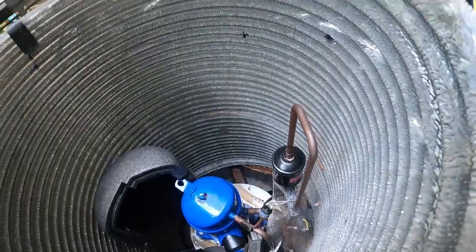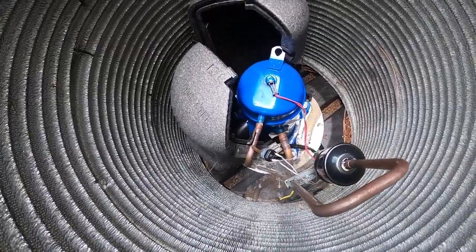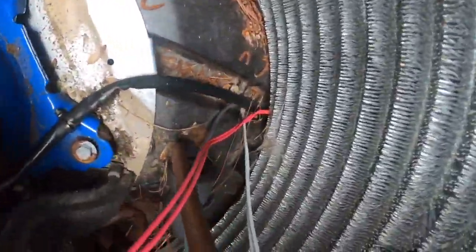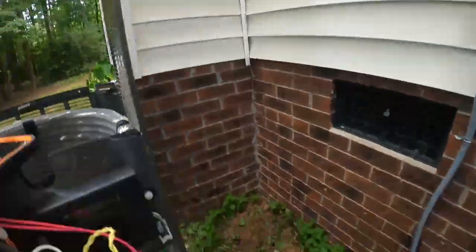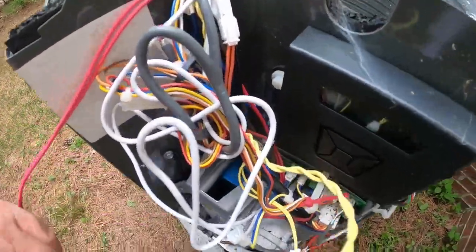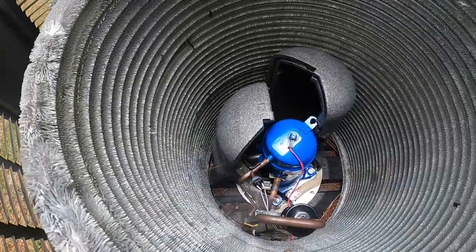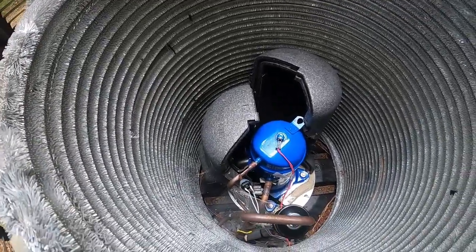Getting the new one in is a little tricky. I got the new one back in — all I did was snap that on, straightened out my wire, and there's a little channel down in the bottom where the harness goes through. I laid that plug down in that channel and was able to reach in over here, grab it, pull it out, and run it back up the inside, then bring it over the top where I'll plug it back in. Not that bad getting one back in. Let me get the cover back around the compressor and get the top put back on. We'll fire it up, check our sensor, make sure everything's reading right, and that should fix our problem.